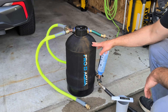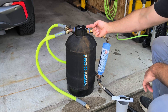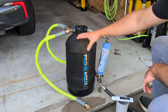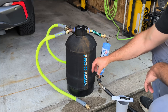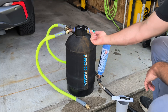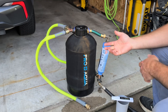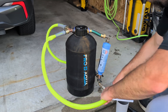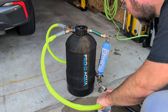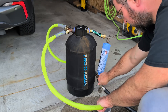I got to looking at the pieces and parts of it and figured out this base is just a resin water holding tank, similar to any water softener. The head gets the water coming in, it goes down through the media, and there's a tube that goes down through the media with a head at the bottom and a filter. It goes through that, up the tube, and out the exit — in this case I've got a quick connect over to my pressure washer. My water here is pretty terrible for spots, which is what led me down this entire rabbit hole.